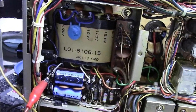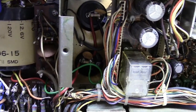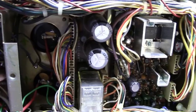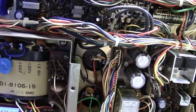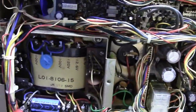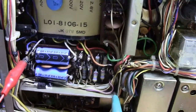Just a quick little shortcut you guys might be able to use. Please be very, very careful in here — major league high voltage. If you put your fingers across that power supply it will get your attention in a split second, and it's extraordinarily dangerous. If you don't know what you're doing, find somebody who does. Right now there is no high voltage because the rig is not plugged in — the only thing operating it is my trusty Lambda regulated power supply. You don't need this type of supply; all you need is a 12 or 13 volt supply that will supply a little over an amp of current.